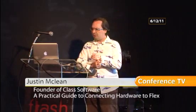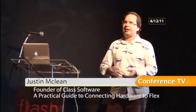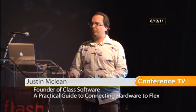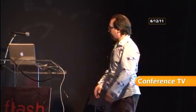They consume very small power, the Arduino board I'm handing around at the moment. Depending on what you plug into it, if you plug a couple of LEDs into it, it's going to consume 30, 40 milliwatts. They have sleep modes on them, so they can actually go to sleep and wake up, and when they're in the sleep mode, a single 9-volt battery would probably make them last 1 or 2 months. So, as I said, power is still an issue, but they're getting there towards solving it.